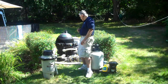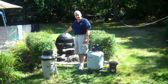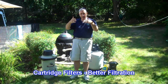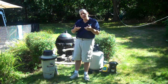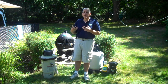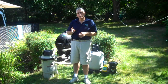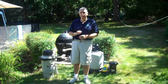The second kind of filter, and growing in popularity, is the cartridge type of filter. Inside this filter are cartridges that have pleated material on them, and those work to pull out any particulate being filtered out. A cartridge filter will filter down to roughly between 10 and 20 microns in size, so you can get finer filtration — up to about four times as compared to a sand filter.